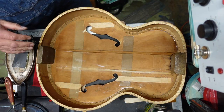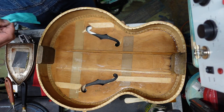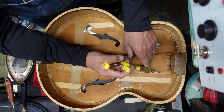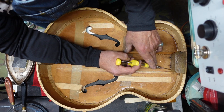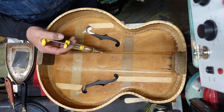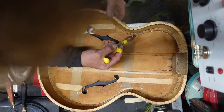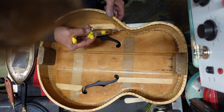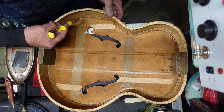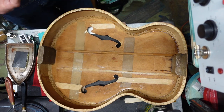And then we're going to redo these strips over here with some of our brand new scrap apparatus and take and use our glue injection needle and do a little Archtop Botox right here on this grain crack right here. And then go along and anywhere where we've got like this separation, a little bit of this kerfing right here, we're just going to go along and retouch this stuff up. So you see how this lays out a real nice bead here? Yeah, we don't want to be back in here for another 80 years because I'll be here, but I'm not sure y'all will. Right down there to the tail block.